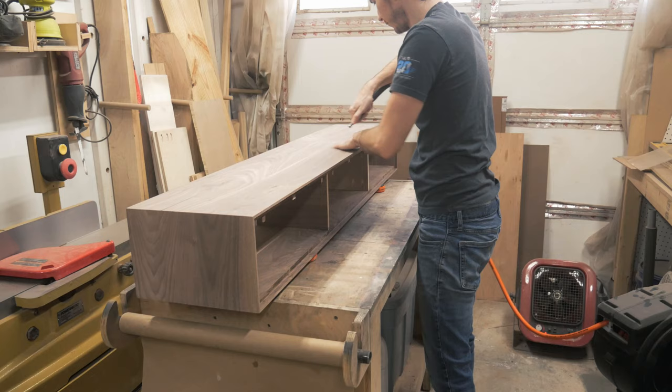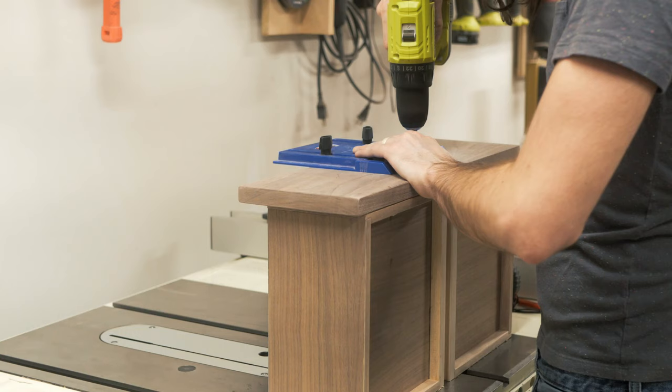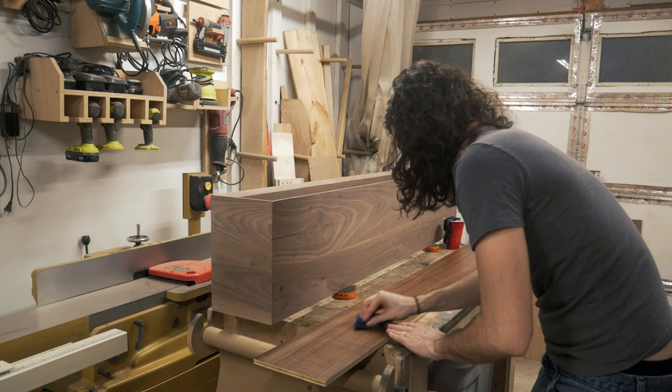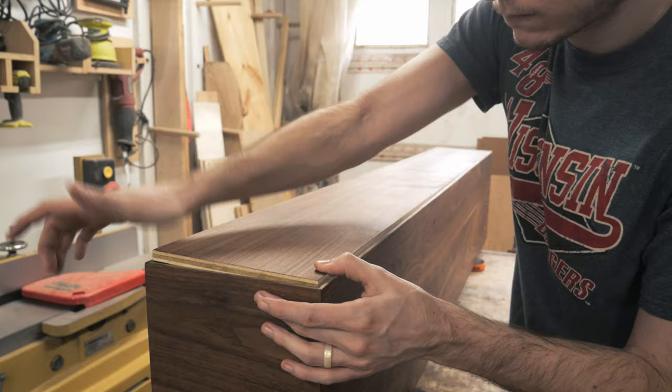Next, I remove all the dust using an air compressor and mineral spirits. To attach the base I'll be using these figure-8 clips. For the drawer pulls, I used this hardware jig by Kreg to drill the mounting holes. Now we're ready for finish — I really loved using Rubio Monocoat on the live edge dining table I did, so I decided to use it again for this. Just wipe it on, let it sit for a few minutes, and then buff the excess away. I then glued the back panel into place and added two dividers on the inside due to slight sagging which interfered with the drawer faces. I originally wanted to pocket screw these in place but decided against it because I was worried it would restrict wood movement on the top and bottom.